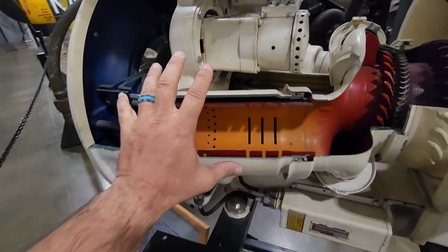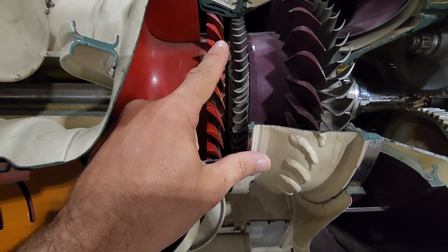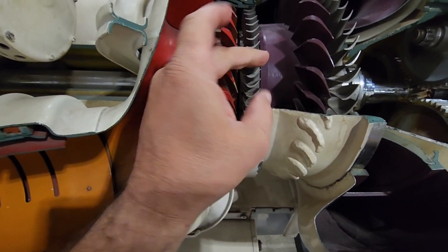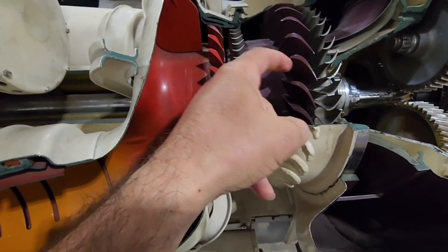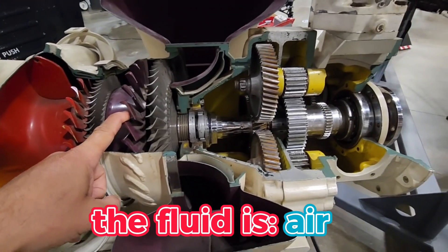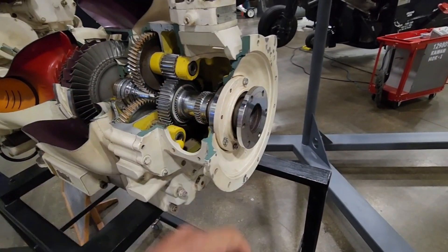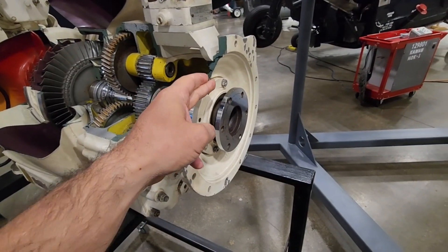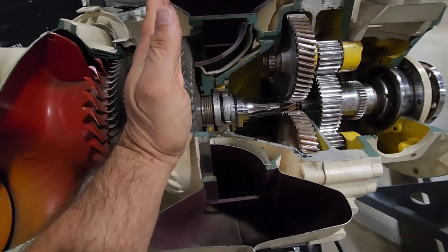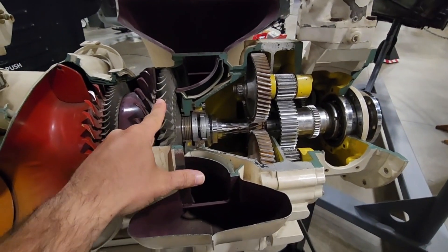After the compression, the burn, and the expansion, there are stators — they're like little wings that direct the airflow into the cups of the turbine, and the turbine spins up. The straight stators direct the hot gases to the business end. All we're trying to do is spin a shaft to couple it to a propeller or a gearbox. From here on, this section is free — nothing connects this shaft to that shaft. This is called a free turbine.